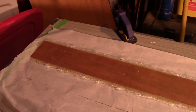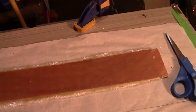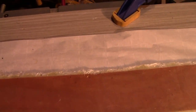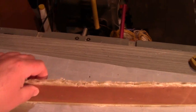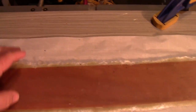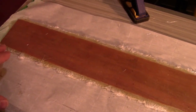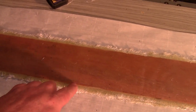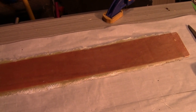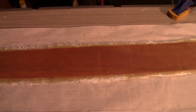Alright, after the peel ply is removed and the boards and all the weight and everything else, this is what we're left with — a nice piece of Luan with a great surface on it. It's just a little bit textured. I don't want to touch it too much with my ungloved hands because it is fiberglass covered, but it's a lot stiffer, much more stiff than it was. It still has a little bit of flex. I took a pair of scissors and trimmed off some of the fuzzies, but I'll run this along a table saw to get rid of all the extra bits of fuzz along the edge. That's a good lamination job with fiberglass — one layer of chop strand. I will do some more work to it tomorrow. It came out pretty well.